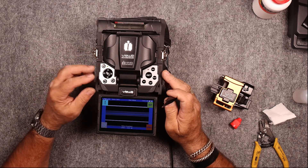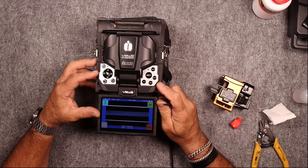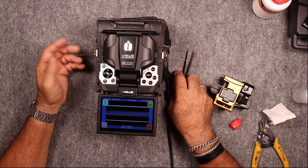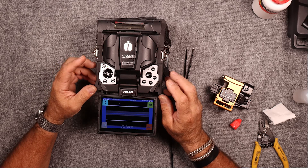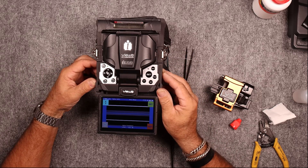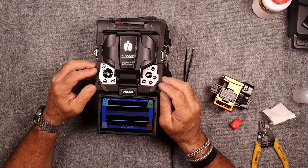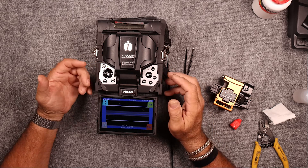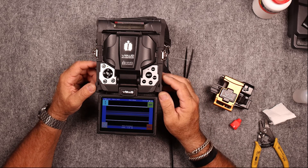That's a future video that will be coming up — doing a bi-directional shot and averaging out splices, showing you how that's done. So right now, that is the arc stabilization or electrode stabilization. Just go into your maintenance menu on your machine, follow your manufacturer specifications — some like the single fiber going all the way across, some like the NL22 fibers — just follow the processes. Stabilize the electrodes. Once the electrodes are stabilized, go back through and do a sample burn. You may also want to proceed on with an arc check and do an arc calibration.